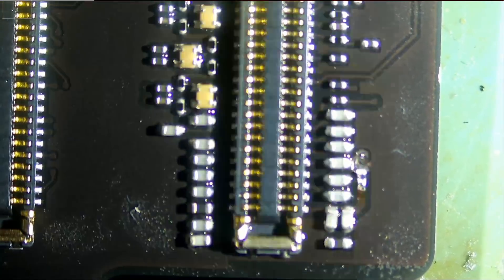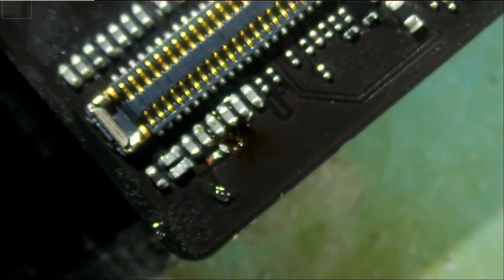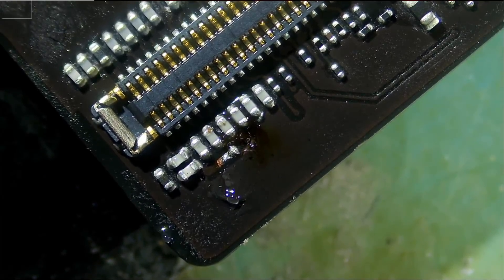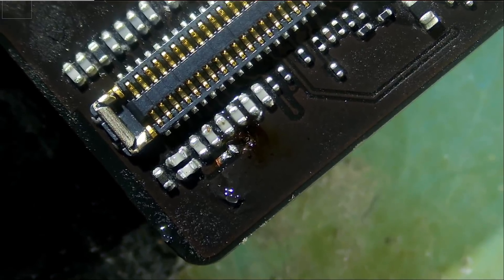Since it's going to be impossible to solder a filter onto the very tiny via, we're going to run a jumper wire to complete the circuit, because we need to complete the circuit in order for backlight to work. This tiny 0201 filter will have minimal effect on the circuit, so we can replace it with a jumper wire.